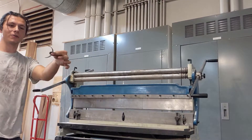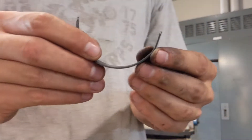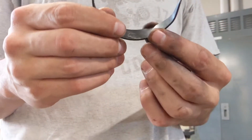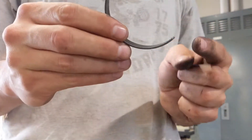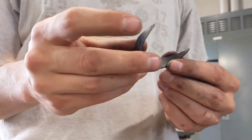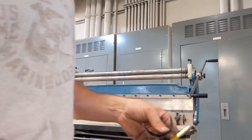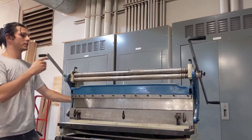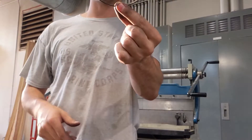That first pass might be close to three inches. I got this little straight part here, so I'm going to try to uncurl it by sending it in the opposite way to compensate. The closer you get the radius, the easier it'll be when you're welding everything together. All right, there you go — that's probably a little better.